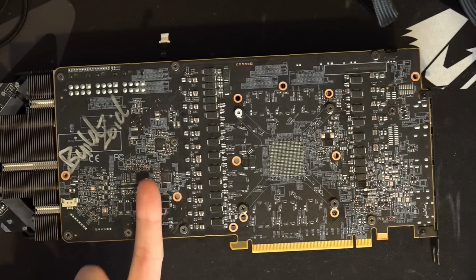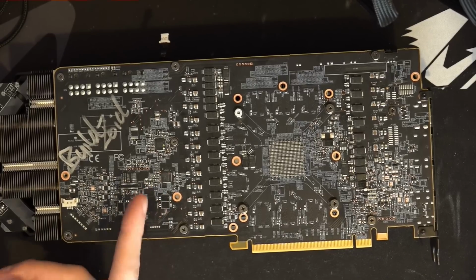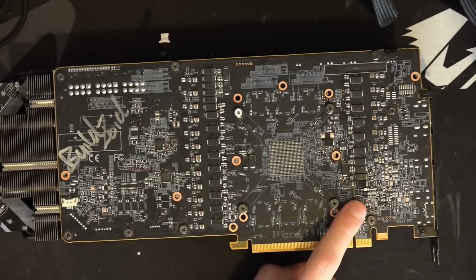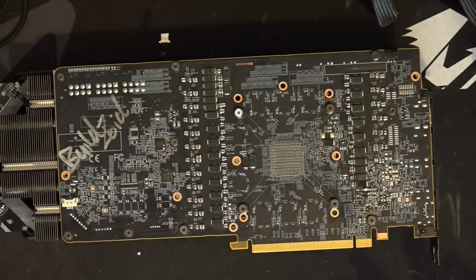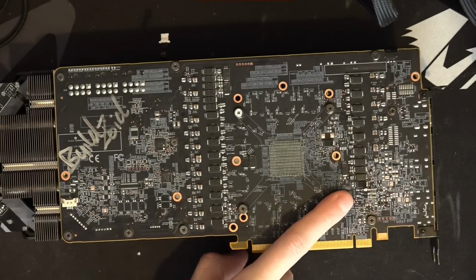The main reason I don't like soldering wires to test points is that's how you rip traces out of PCBs, whereas this is meant to have a connector attached. Now, admittedly, you can glue the wires to the PCB, but now you're adding glue to your card. Like I said, uncivilized. That technique works fine, but this is, in my opinion, way better.